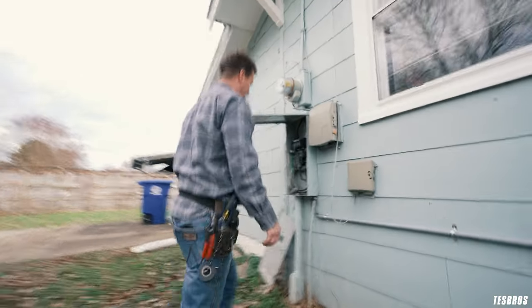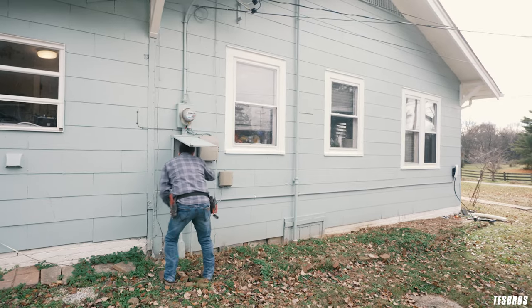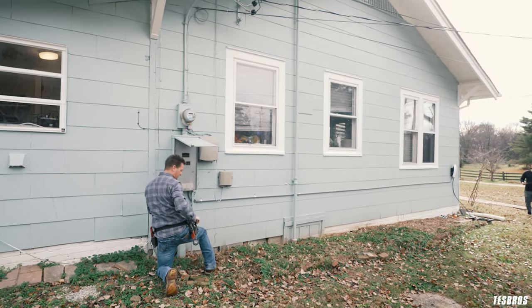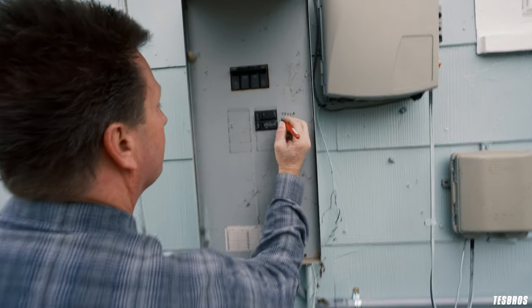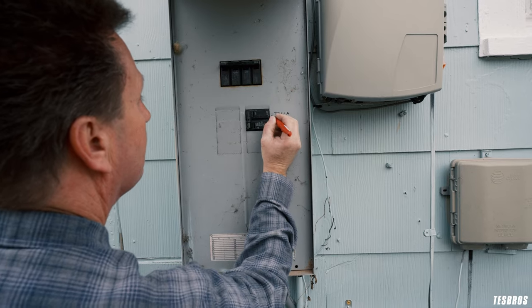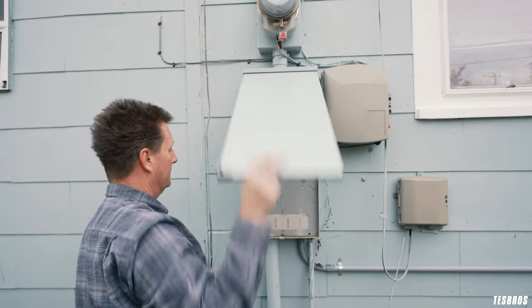The charger is installed and it's time to test. Important reminder: the breaker is off while you're doing all the wiring — do not do this with the breaker on. The first step is turning it on. One thing you also want to do is label the breaker. Since this is an outside panel I don't have many breakers to confuse, but most people installing with their main panel will have dryers and other circuits, so make sure you label it.